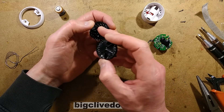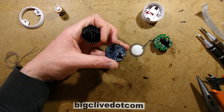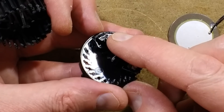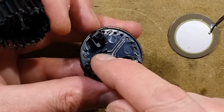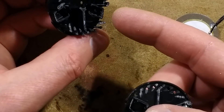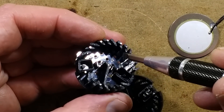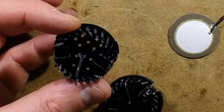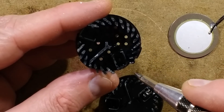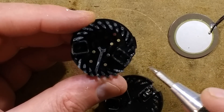Here's the smoke chamber. The detector is here and the emitter is here. There's the emitter and the detector — they're looking into this area here which has a barrier between them so they can't see directly. The area they're going to detect in is going to be this area here. The louvers at the side are overlapping so that although you can see light shining through, I don't think there is a direct optical route.